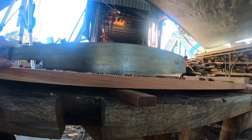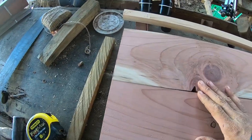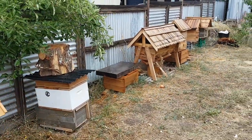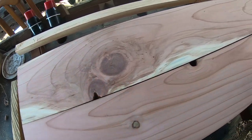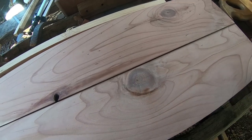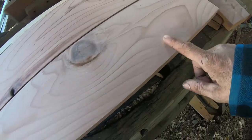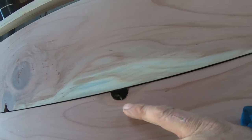You can see there it's got a fair bit of a curve. I've got to joint these two boards together — this is for a Kenyan beehive that I'm working on my other channel. Jointing this with hand tools is going to be rather tricky because of these knots here, and all sorts of grain direction changes. The simple solution would be to flip the board so I've got lovely clear grain on the jointed edge, but I want to use this hole here as a natural entrance for the bees coming in and out.